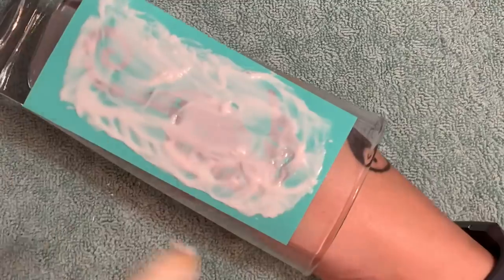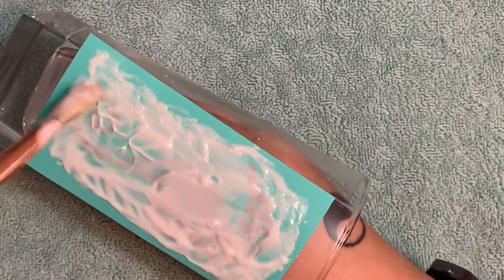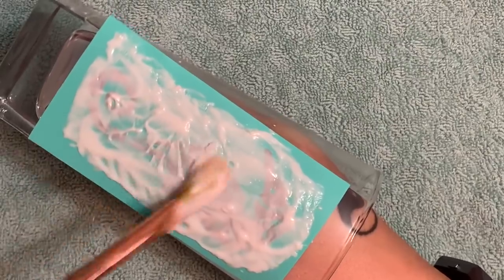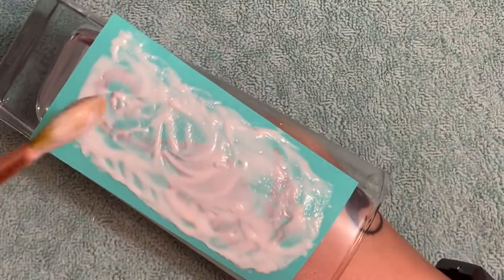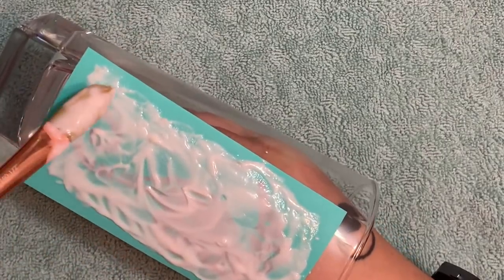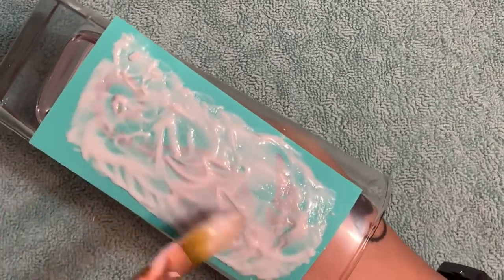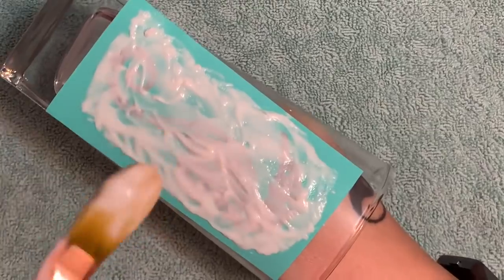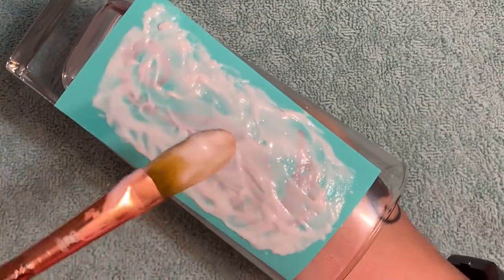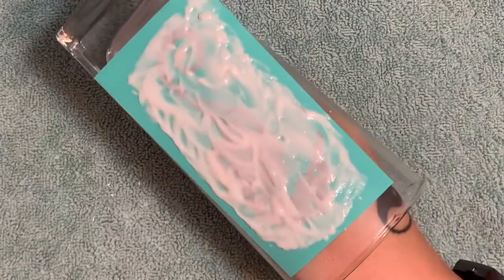If you're going to use the cream on a whole bunch of things, put the lid on, place it in a pot of hot tap water — don't boil it, just hot tap water — and let it sit for about 15 minutes. A lot of those crystals will dissolve. If they won't dissolve, take your brush and place them over on a piece of your transfer or stencil, because crystals sitting on the glass can create little scorch marks.